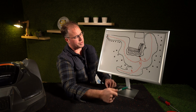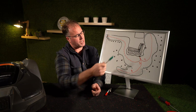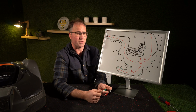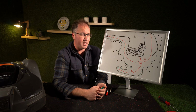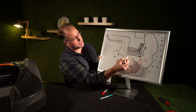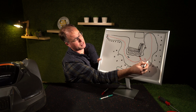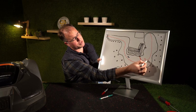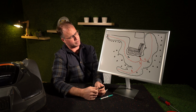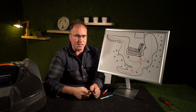But getting back to the original theory on that 400 meter limit, personally, I just ignore it, to be honest. If you've got an install that's too big on boundary wire, it'll be too big on a guide. You should have an install that's too big for wire, where a guide wire can't work. Saying that, I like to keep it under 150 meters for a guide. So an install like this, for example, our guide wires might be, this one here could be 90 meters easy, this one here could be 70, and this one could be about 85. So it's easy to get that metreage of wire up. This is a really typical install for a 430, and I do have guide wires that would be about that long. Given that that is about 90 meters out there, and then the rest of the install around there, I don't find that to be too much of an issue.